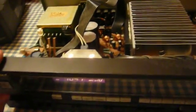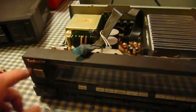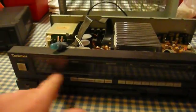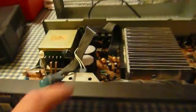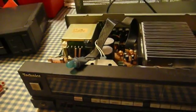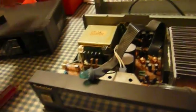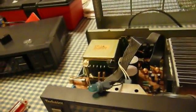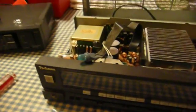While working in this little receiver, I happened to notice a light bulb right behind the power button. I didn't know if maybe the power button somehow illuminated or what. It turns out that little light bulb actually lights up part of the dial in the unit. Nobody ever missed it when it finally failed because the display is backlit by a different bulb. This bulb is bad and I wanted to replace it. I pulled it out of its little mounting to discover it's nothing more than a little automotive-style bulb — it's even a 12-volt bulb. For a princely 89 cents, I bought a replacement.